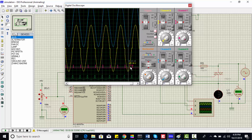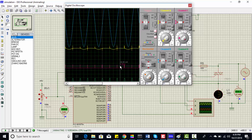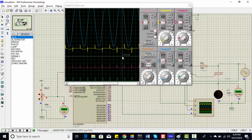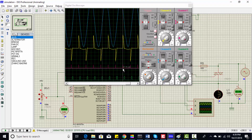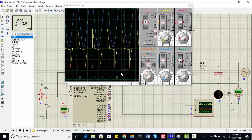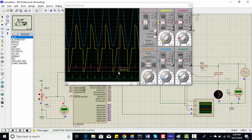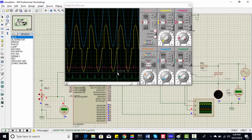As you can see now we're getting a full AC wave here and full voltage. Let me show you again — first the firing angle will be maximum, then it will start decreasing. You can see the firing angle moving along with the waveform. The firing angle will become minimum when this waveform becomes equal to the input waveform, and the voltage will become equal to the supply voltage.